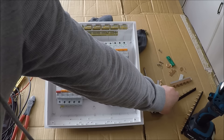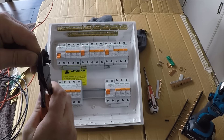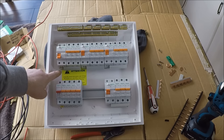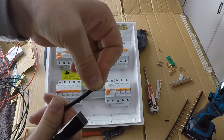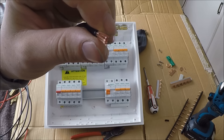All fired in. They do stick down a wee bit unlike their counterparts which fit flush, but I won't dwell on that. Starting with the neutrals: cut the bent end off the cable, strip it back. When putting cables into screw terminals you want to twist them up — that makes it stronger. But when putting them into clamp terminals, which is what's inside these breakers and RCDs, you don't want to twist them — keep them flat so the clamp compresses the copper evenly with more surface area contact.